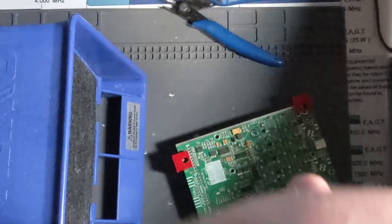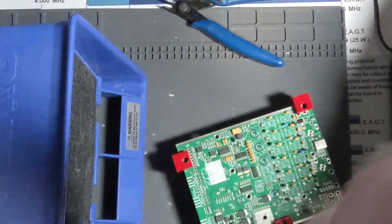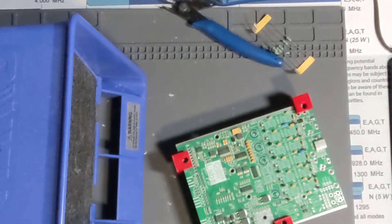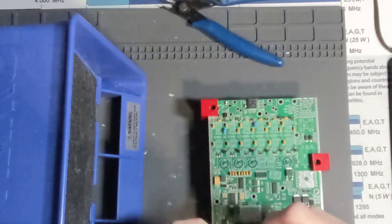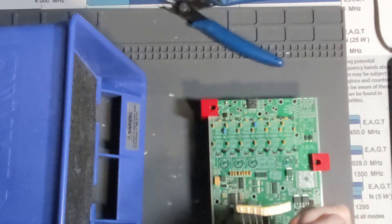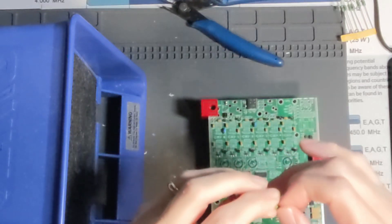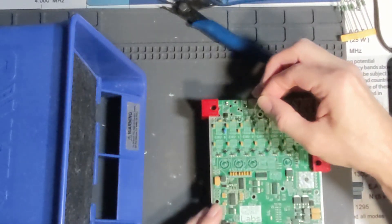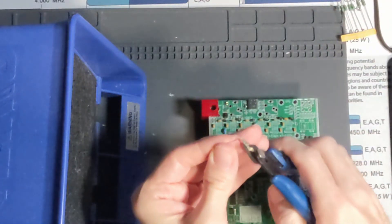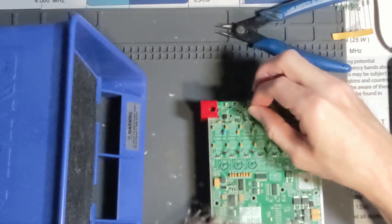Let's set this aside because I know I need those transistors in a minute. So again with the board oriented this way — these are just inductors, so they don't have any polarity. I'm going to try bending these; the instructions say bend close to the body. The first one goes here. Another thing — I want to orient them all the same way on the board just to have them look nice and make it easier to troubleshoot if you need to read what's on them.